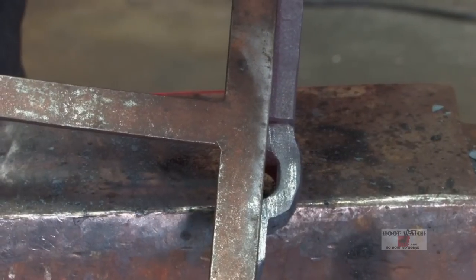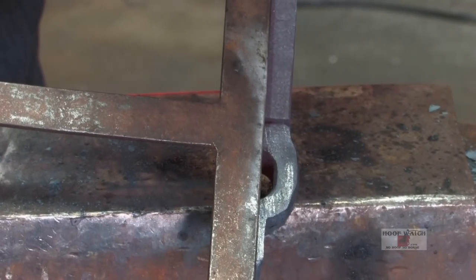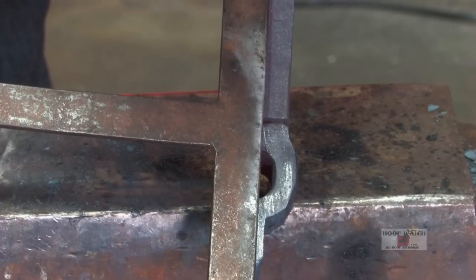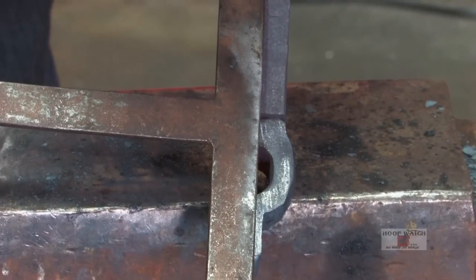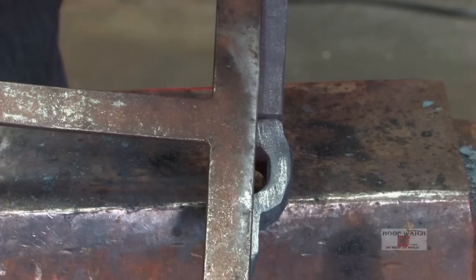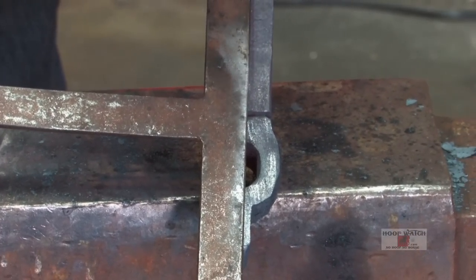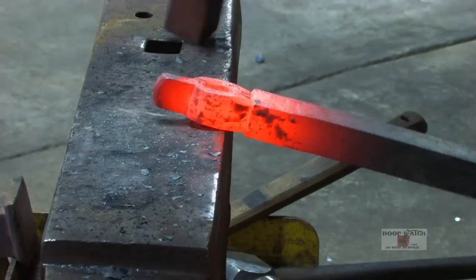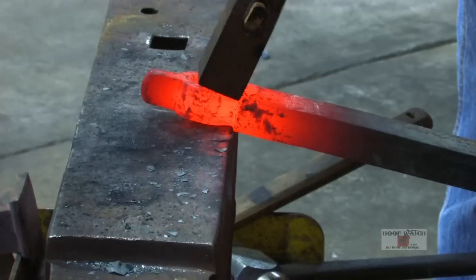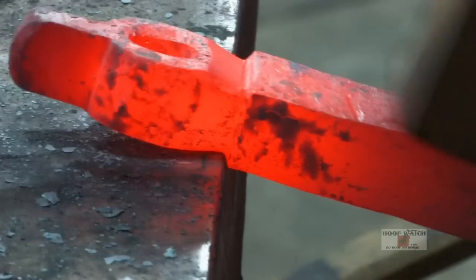Our goal is to come right through the center of everything. Part of the test is to have the fuller actually run. And if you've got the head off or the eye off from the blade, it'll buck or it'll jerk sharply every time it hits with the striker, therefore causing it to mushroom or collapse faster. And then we're gonna come all the way around. Good job.